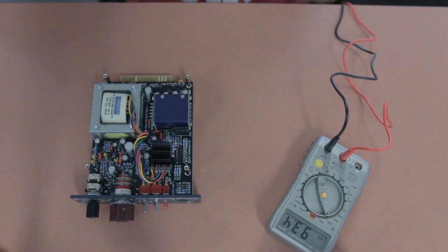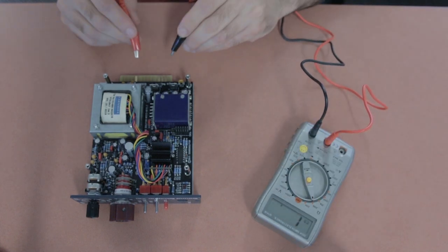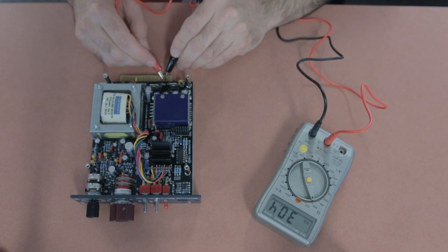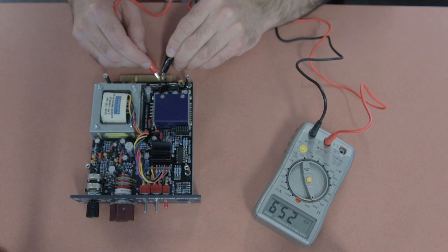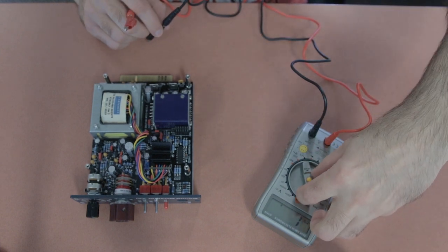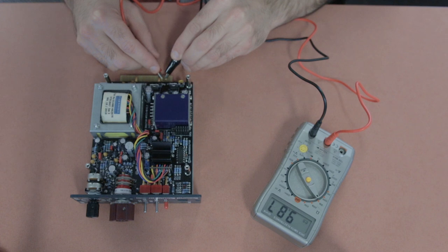Now we start basic testing. Get a multimeter and test the three pins — V minus, 0V, and V plus — checking for ohms. Refer to the MP573 setup guide rather than the assembly guide for these test points. You should get a value greater than one kilohm at these points. If you don't get greater than one kilohm on your multimeter, there's a short somewhere — inspect the board and check for shorts. If you're getting the right readings, you can move on to test two.